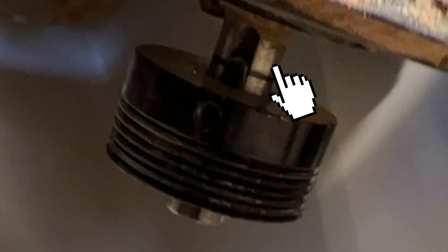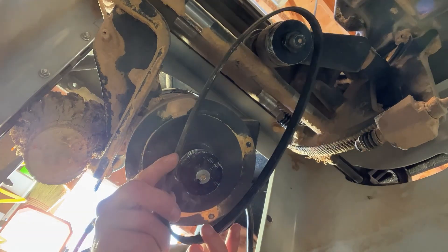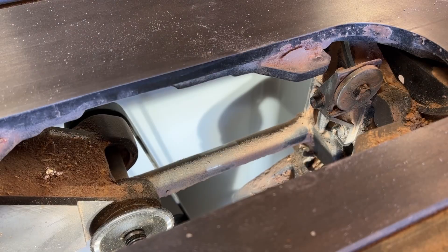I'm a terrible videographer — I did not record this part either, so I'll just explain it. I reinserted the flywheel onto the motor shaft, this time aligning the key slots on both the flywheel and the shaft, and I pre-inserted the key. Hopefully you can see it here. And I also pre-inserted the grub nut. Now I'm just going to go ahead and tighten her down and it should be good to go. So far, so good — nothing appears to be stripping out. Just snug it up. Awesome. And with the belt now securely back in place, I can start buttoning the rest of the saw up and get it ready for a test cut.